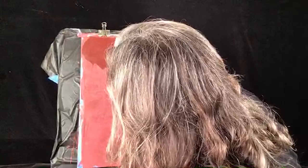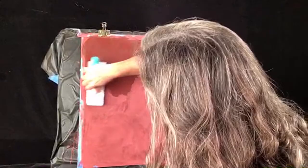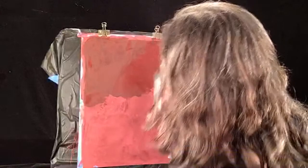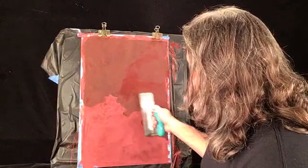You can get in there and burnish it and get that beautiful gloss you're looking for. As you do this the plaster goes on smoother — it likes to stick to itself better than anything else. It just looks smoother and slicker as I put it on. You can put on as many coats as you want. Somebody trying to even out a wall with imperfections should lay down two coats of marmorino, which is another product. But if you have a really good smooth wall you shouldn't have to.